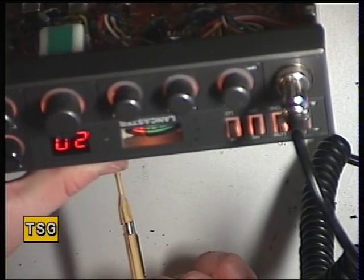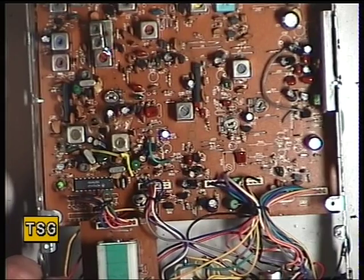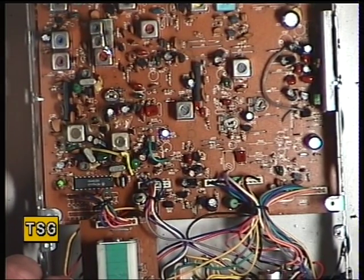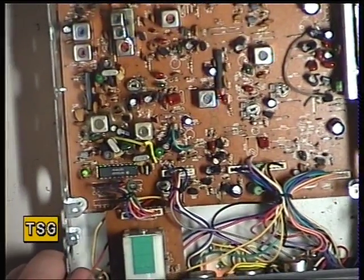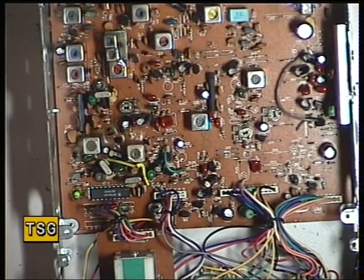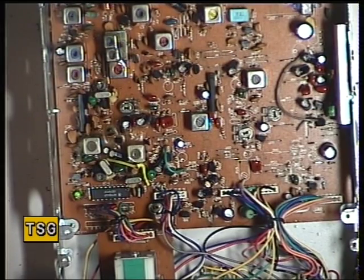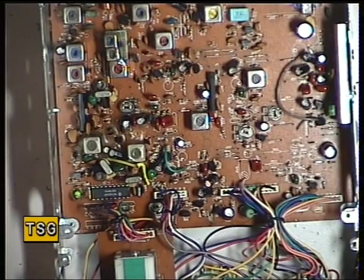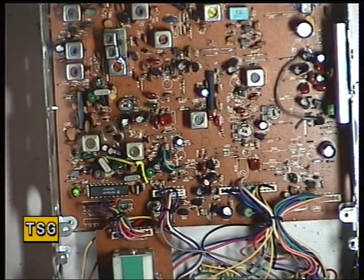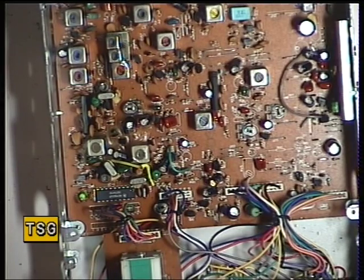I took the opportunity to change one of the bulbs — there are about half a dozen bulbs on this front panel. Incidentally it draws 500 milliamps on standby, so if you're running this parked up on a car battery it's not going to last as long as most sets. RV1 should be the signal meter — and indeed that's now S9. Come back to the squelch, switch the generator off, switch squelch threshold, switch the generator back on. Let's try again: set threshold, generator back on, switch the squelch to full — comes on at S9, that's better.